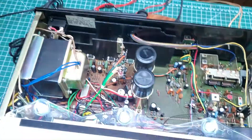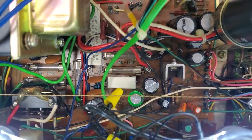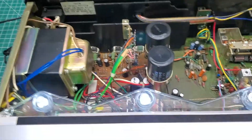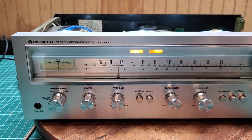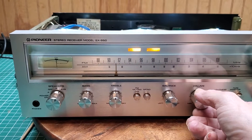As far as on the inside, I went through everything. I went through and changed out the caps — that always seemed to give me an issue. I tried to leave this as original as possible. Went through, checked all the solders and everything else. Of course, on the inside, hit all the potentiometers with the Deoxit and so forth. I always say that word wrong, but...